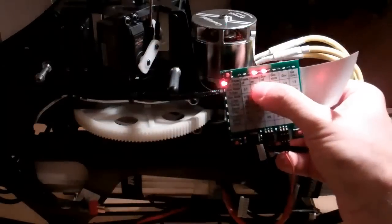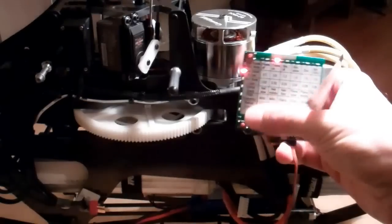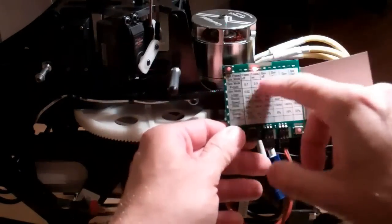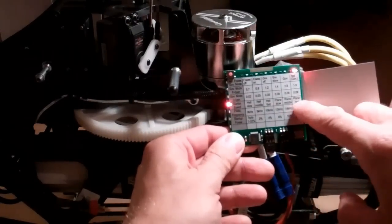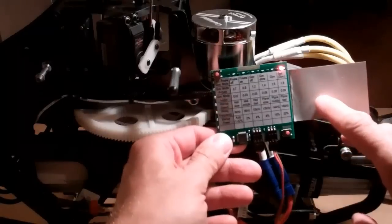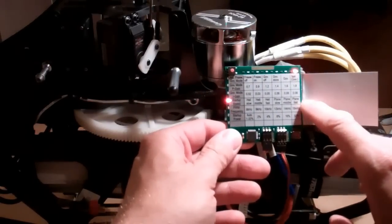And on the second page we have freewheel on, governor off, of course. And these were the settings for the internal governor, but you won't need them. Was 0.09, 0.05. And here's what's very important. Under startup speed, I used plain fast, and that seems to work very well with the governor and the Vbar. It gives it ample speed to control the motor through the ESC.